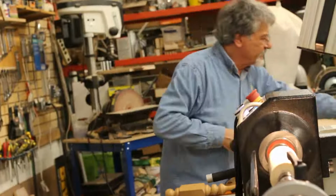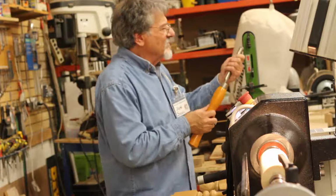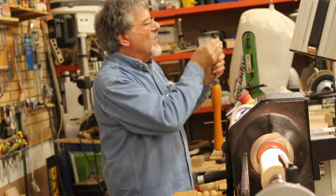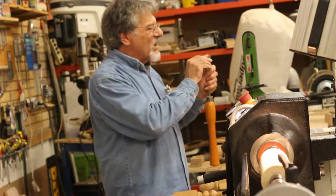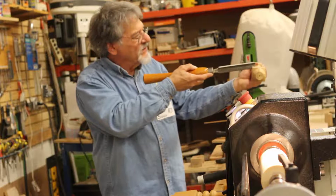So what was I going to say about the roughing gouge? Okay. When you sharpen, a lot of people make a mistake when they sharpen a roughing gouge. As they're rolling this around on their grinder, whether it's a belt or a wheel, whatever, they roll it too far and they end up with these corners getting rounded. That's a very no-no. You want these corners to be sharp right angles. And the reason for that is that when you're roughing out and you come up into this, you want to be able to get the chisel up on its side so that you can rough out right up to the shoulder. Now, how we make these transition things, I'm going to get to that in just a little while.